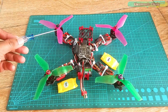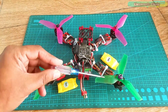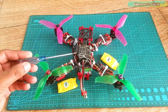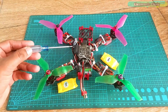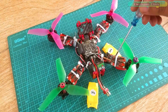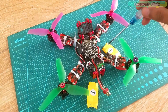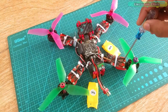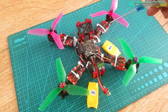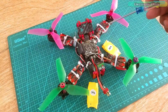The 6 channels of the FlySky receiver are connected with the 6 channels of the NAZE32 flight controller — simply connect them in the same order. These are the same 30 ampere ESCs; this time I just removed the yellow shrink tubes and directly soldered the motor wires. This time I am using a new frame and new motors, so I did the motors calibration the same way as I did for the 1400kV motors.